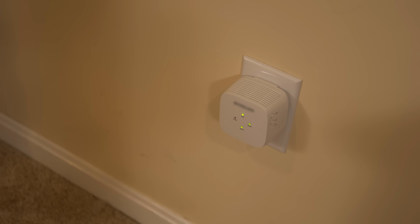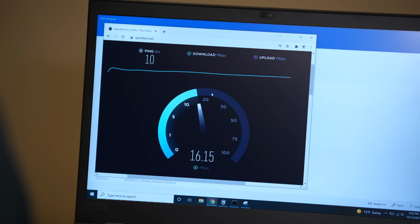So I went out and bought an extender. Didn't help any situation. Yeah, so extenders put up their own Wi-Fi signal, but they still have to communicate to the router. And if you have a really bad router signal getting down here, guess what? It's going to cut your signals further in half. So it's not a great solution, especially for a wireless version. Let's see how bad it is, though, okay?